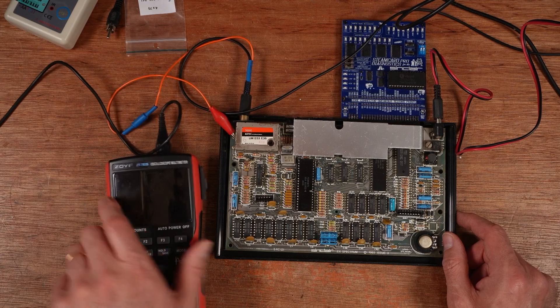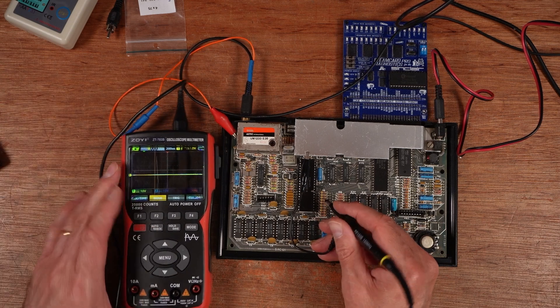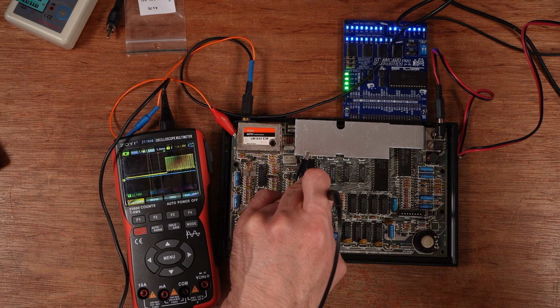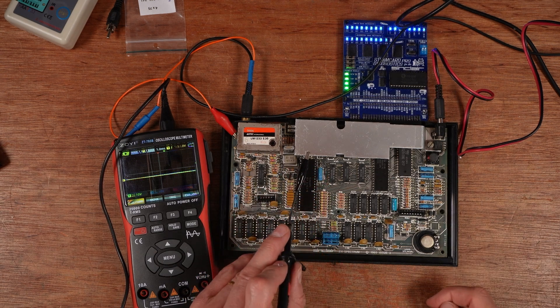So what is wrong with this one? I've already connected it up to capture so I can show you that it is working — that's the diagnostics running there, and normally that would be going beep beep beep. I've marked pin 28 here on the ULA so that I can see any activity coming out of the ULA on my oscilloscope. We've got a full capture of the sound actually coming out — nice square waves showing you the actual signal coming out there.